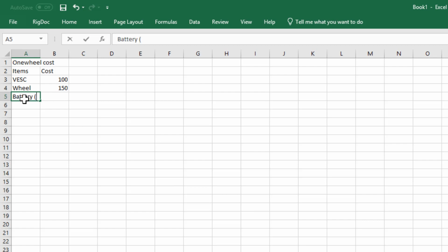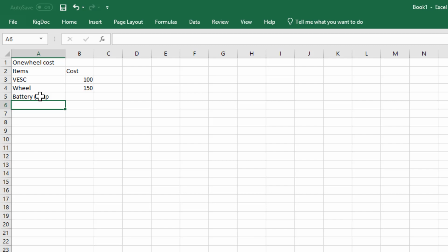Obviously, we need a big battery pack to move the heavy load, and by heavy load I mean me. So at least a 10S2P battery. Again, I have tutorials for making battery packs, so that should help you there in case you need to know what a battery pack is and how to make one. So a 10S2P battery pack has 20 cells, and each cell should cost you about $3 on average, so about $60 for the whole battery pack. The Arduino, the MPU, and miscellaneous items, including the footpads, the aluminum rails, the wooden deck, and a few other parts would maybe cost about $40 or something.